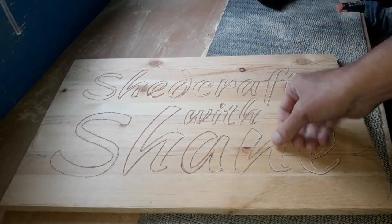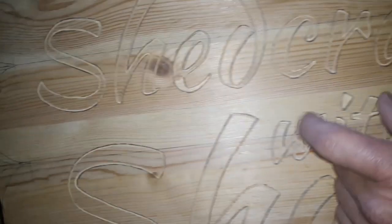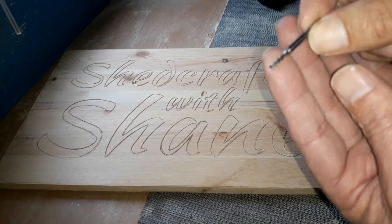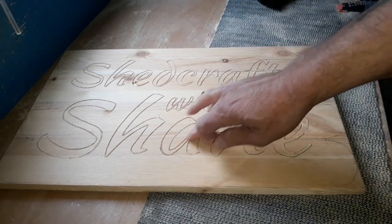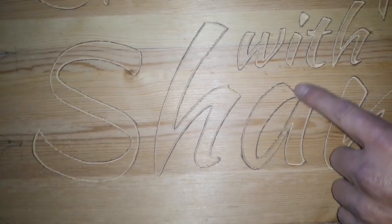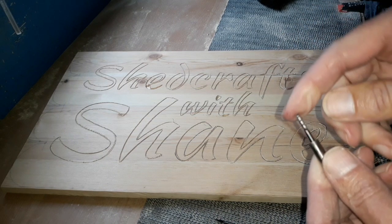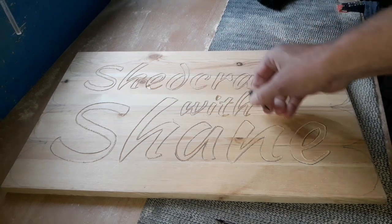We've gone around with our CNC bit and had no issues — it cuts really nicely with this stuff. I've removed a larger section that would have taken the CNC bit longer, so I like to remove those areas beforehand. When we put on the mill end bit, we've got a depth gauge and we simply set that to the same depth. I've just noticed I've missed a small bit, but no problem — we'll nibble at that with the mill end bit as we go around. Simple case of removing the CNC bit and popping the mill end bit in the router, then we'll start removing the inners on the lettering.